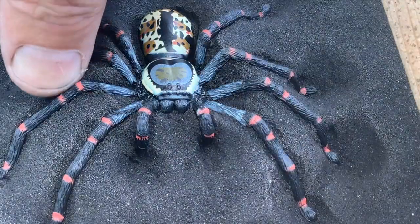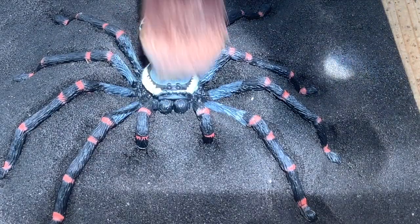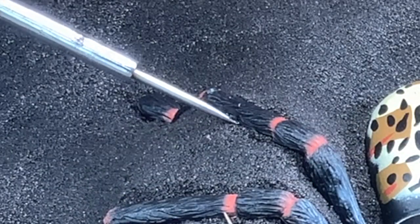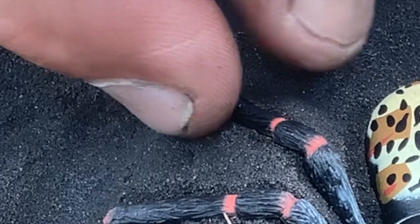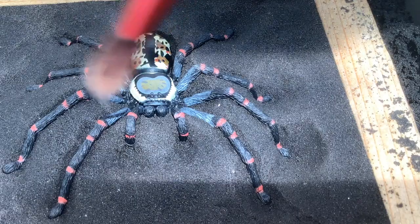Anyway, the makeup brush makes an excellent tool to sweep away all those little grains of sand that are in the way. And just go round and round your piece and try and prepare it as best you can. The more preparation work, the better the job will turn out. And also there'll be less flashing, which nobody likes, because every time you try and sand or cut away silver, you end up losing it.